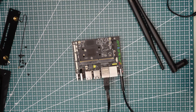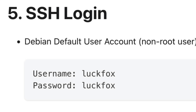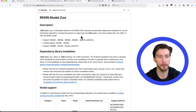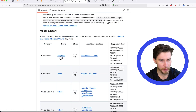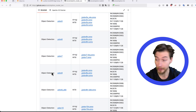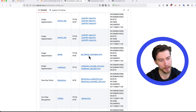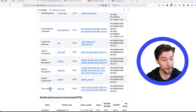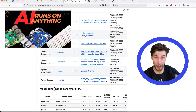There are multiple ways to access the board; the easiest is using SSH, protected by a username/password combination. Rockchip provides a large library of readily available machine learning models to try out on the board with NPU acceleration. There are common ones like classification with MobileNet and object detection with various YOLO variants, some OCR and pose detection models, and more exotic ones such as neural machine translation, speech-to-text with Whisper, and even text-to-speech — quite a bit more variety than your regular AI accelerator, which still tends to focus mostly on vision models.